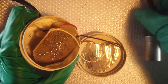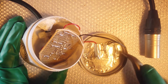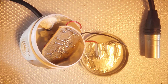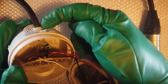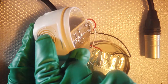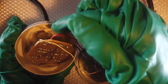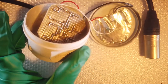Before you seal the box, connect your hydrophone to a mixer and check whether it works. I wrapped the piezo in foil tape before gluing it to the lid, using PVC glue to make sure the box is totally waterproof. I used sandpaper to scratch the surface and cleaned it to improve glue adhesion. The hole for the cable must also be sealed, as it's the most likely place water would enter. Since PVC glue can't work on rubber, I used a super strong glue for all types of materials — seal both inside and outside. Once totally dry, pop it in water and test it out.